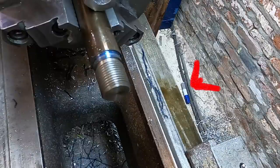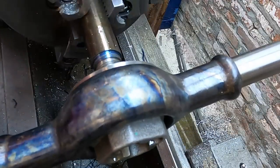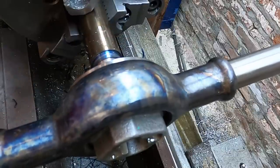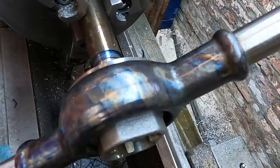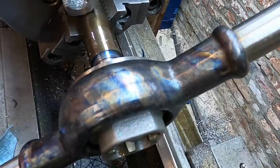I dropped my marker, and I've got to clean up that pile of swarf behind the lathe — not a good habit. But this is what I wanted you to look at: a vintage Greenfield die. Doesn't get much better than this. Love the case hardening. The nut was a little tight on that thread, so I grabbed the appropriate round die and this beautiful wrench and I'm just going to manually clean that up. I placed a rag down on the ways to protect them.